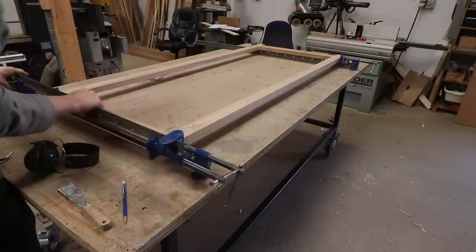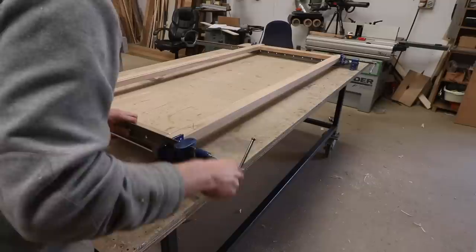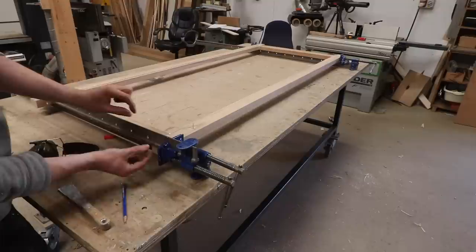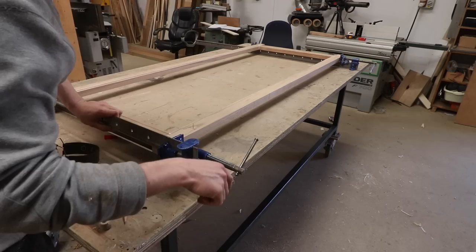Double up my clamps if you've got room on the outside or on the top side where the horns are. I stick another clamp on, again nice and parallel, so you've got your clamp both sides of the timber and it's not forcing it from one side. That piece of timber will tend to bow up with that clamping action, so if you've got one both sides, it will hold that joint nice and flat and straight, with even tension across both clamps.